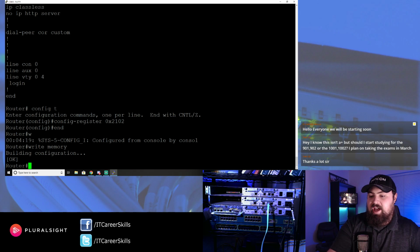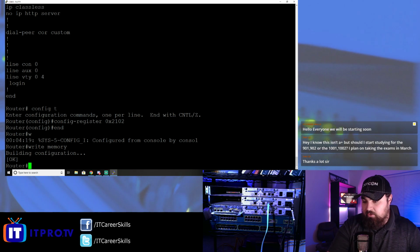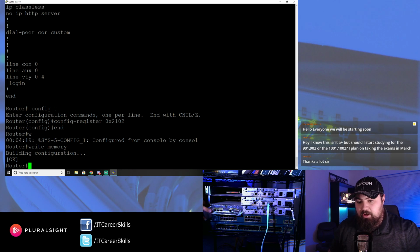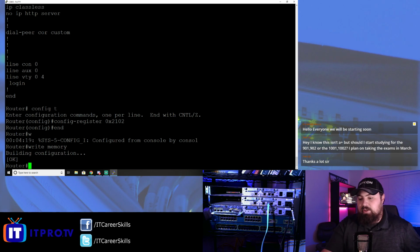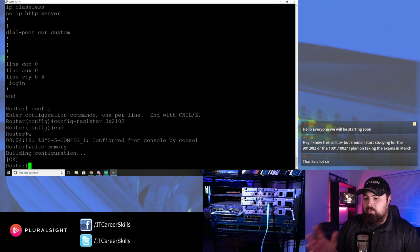So our first task is to configure the host names on router 1 and 3 as illustrated in the topology. I can't really show this on screen, but I'm going to walk you through the steps. We're going to call the one we're plugged into here in the middle router 1, and this router right below it router 3. That's our very first thing we're going to try to do. So we're in our router here. That's the name of it. We got the pound sign here, the hash symbol, so we know we're already operating in an elevated command prompt.